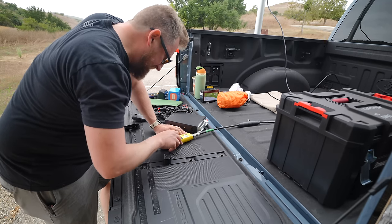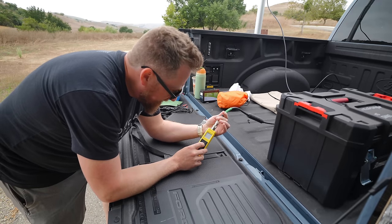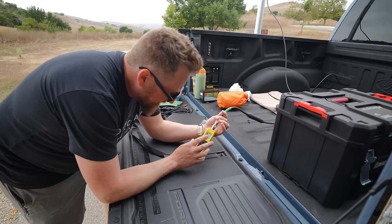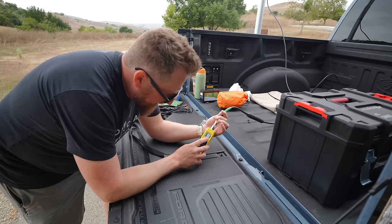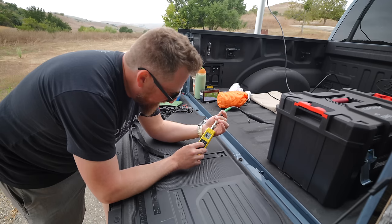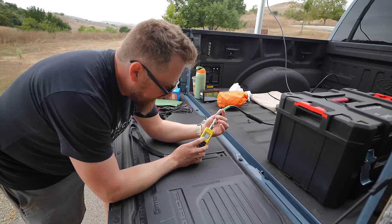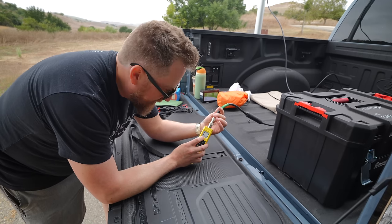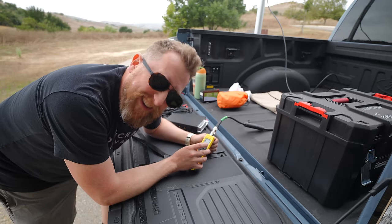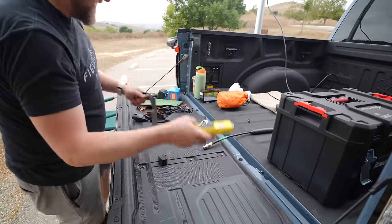So we're gonna go ham. So we're 1.82 on 20 meters. 17 meters, we expect nothing. 15 meters, we'll get something. Not bad, actually, it dips way low. 12, we don't expect anything, but 10, we need 10. Oh, yeah, look at that. 1.6, that's exactly where we wanna be. A little high, it's gonna get up to 1.2, probably in our operating space. We're gonna kill it right now on 10 meters. Yeah, I'm loving it. All right.